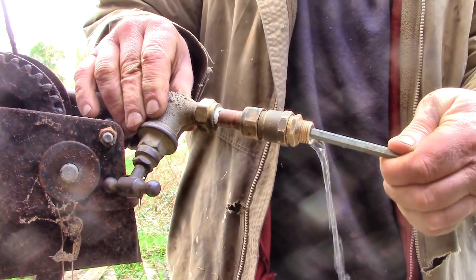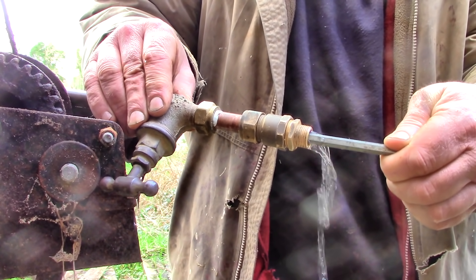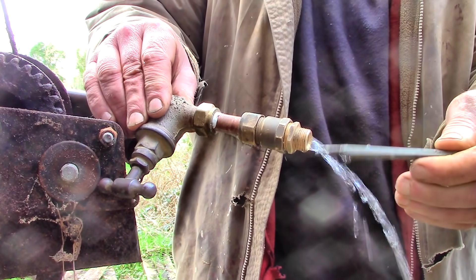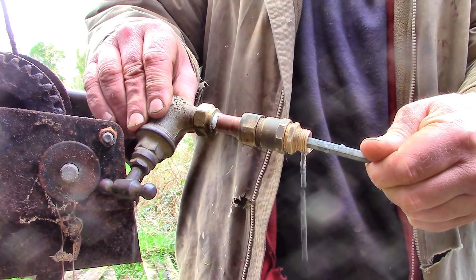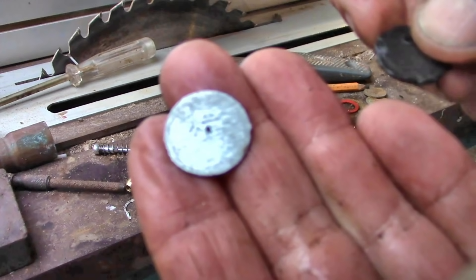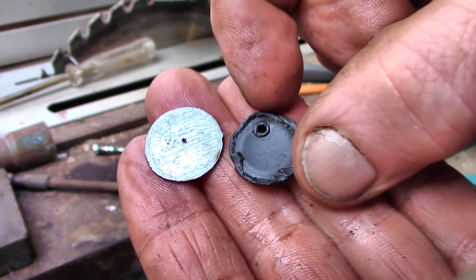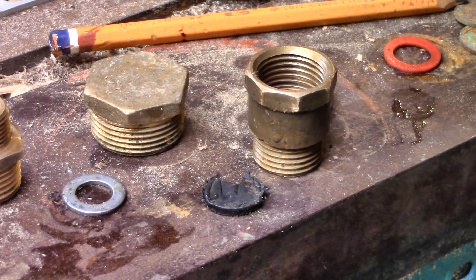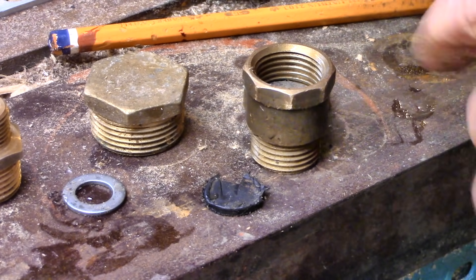Well, I have no idea how much water I'll need for a steam engine, but it seems plenty for now. And could I close it with a plunger? Yes — although not completely. So I cut a new disc out of smoother metal, thinking that might be the problem, and drilled an even smaller hole: 0.7 of a millimeter. In imperial measurements that is very small — I don't know exactly what it is. And instead of a flap in my rubber disc, I made a small hole off-center, to leave the perimeter intact. This time I sandwiched everything with fiber washers to stop any leaks around the perimeter.